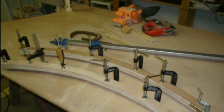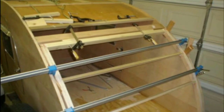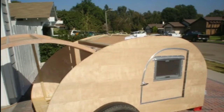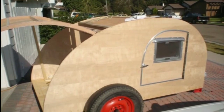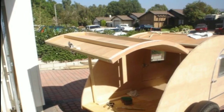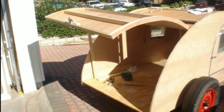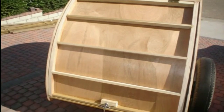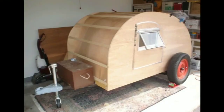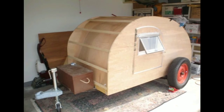I drew out these pieces of wood to make the frame for the rear hatch, kind of just laid it into place, etched it out, clamped them together, grinded them all down so they matched, bolted them together, and put some rafters in. I lined it with some eighth-inch birch paneling as a headliner, put a couple of hinges on it temporarily to make it open and close with a little latch, and I put a headliner completely on the inside of the main cabin.